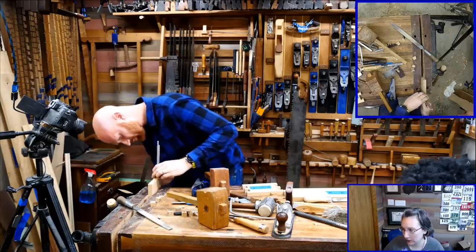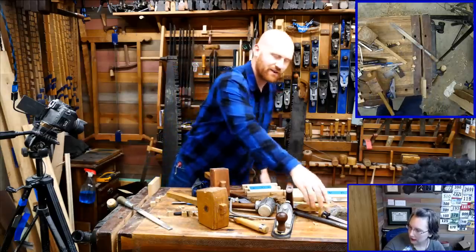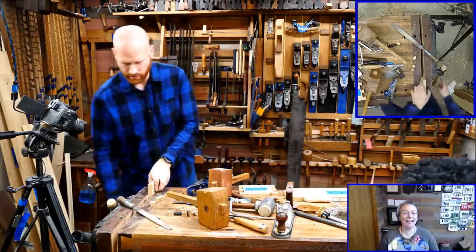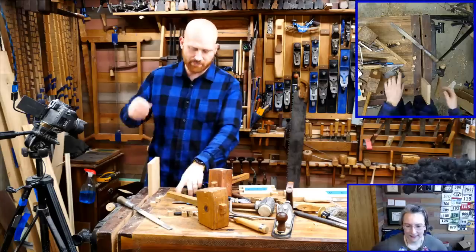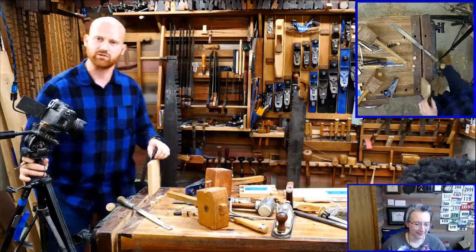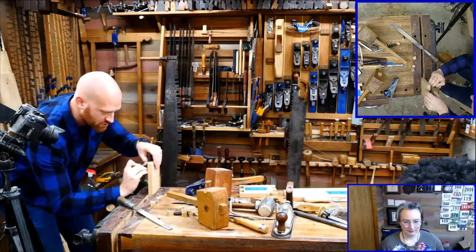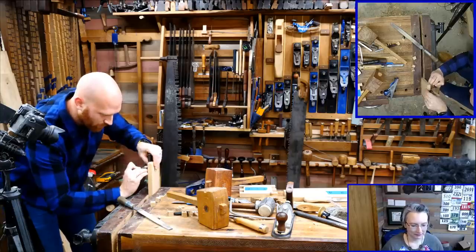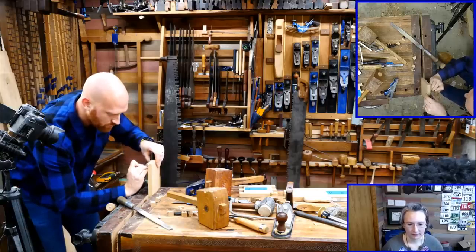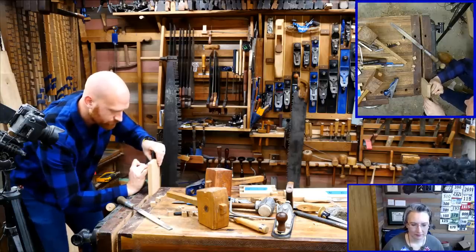It would be a maple dowel, of course. Oh yeah, far stronger than it needs to be. I've used a leg vise with a 1-inch maple dowel screw. You don't need it. It is absolutely mind-blowing how strong wooden screws are. They are incredibly strong, far stronger than you need them to be. If you get up to 1.5 inch, 2 inch, in some cases 2.5 inch screws, they will hold thousands and thousands of pounds. So don't worry about that. That 1.5 inch will do you incredibly well.